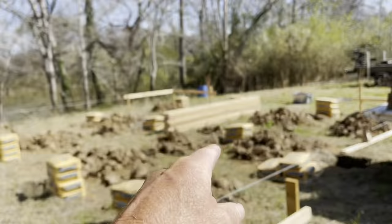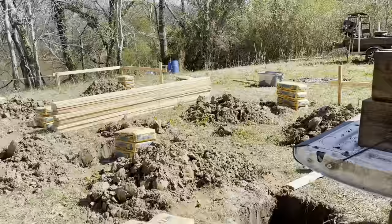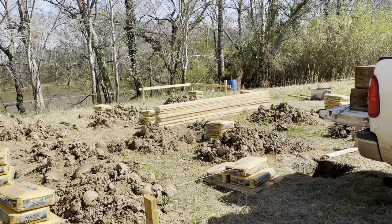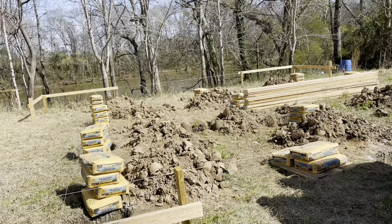I've got some of the floor joists cut right there. That's what I'm working on right now. It's gonna be 24 — you see what I'm putting in the ground right here — and those are the good treatment, supposed to last a long time. What it's gonna be is a 24 by 28 A-frame. It's not gonna be exactly like the one I built in Kansas; it's gonna be a little bit different, straight up A-frame. Upstairs in it — I'm gonna try to get two bedrooms and a bath upstairs. I'm thinking we're gonna have like maybe a 15-foot wide at the top on the second floor up there.